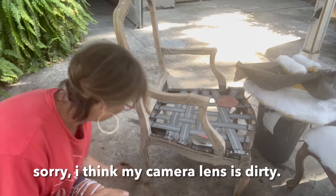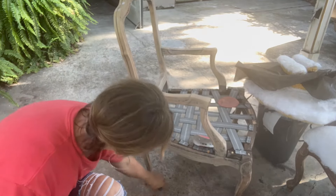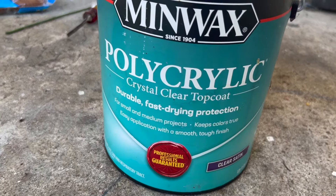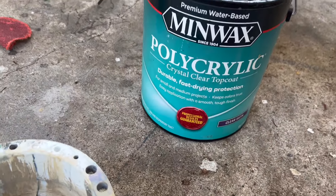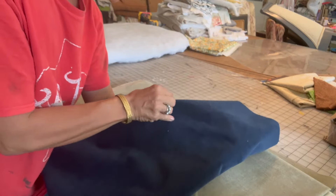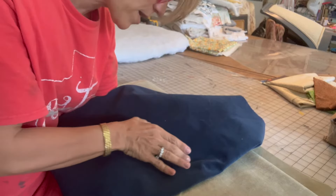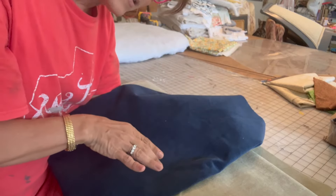The wash stays in the cracks and crevices. You can build up layers, continually going over with another coat to get the lightness you want. For the topcoat I use water-based polyurethane or polyacrylic — clear satin finish — which gives a beautiful velvety finish. The fabric I bought at Joann's in the clearance section: a beige velvet and a blue velvet. I'm going to make it difficult on myself and do a racing stripe of the blue velvet down the center of the chair back and seat.